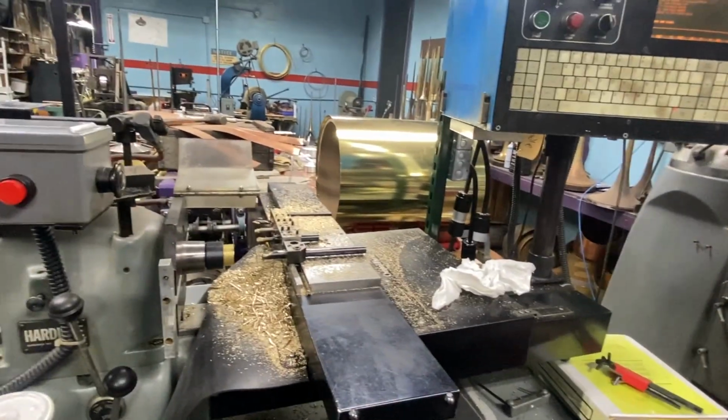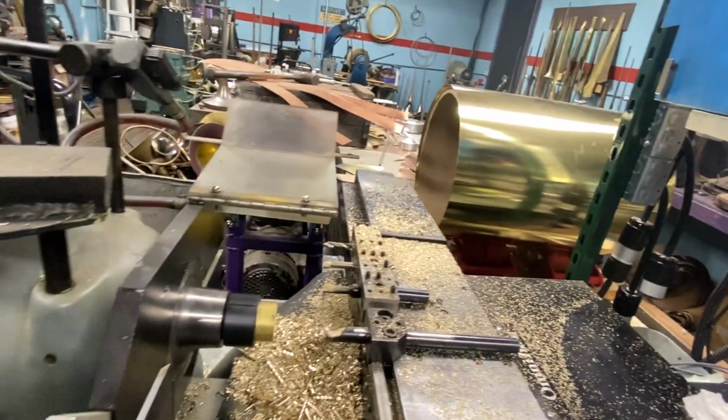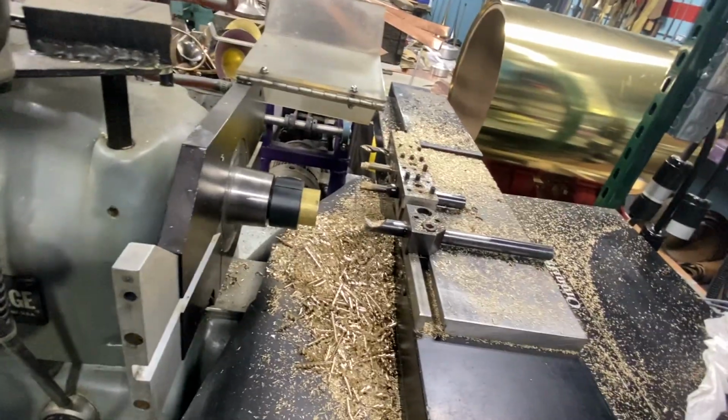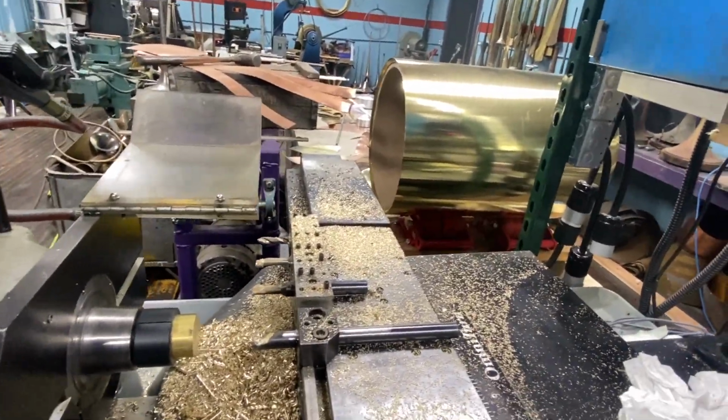The only thing that I had trouble with was I forgot to hook up a ribbon cable that controlled the signal from the controller to the spindle for telling it to rotate. And I forgot to hook that ribbon cable in. I called Mike, and he told me exactly what the issue was in 5 seconds, and I fixed it.